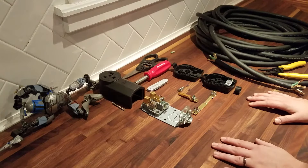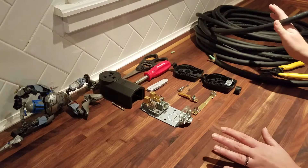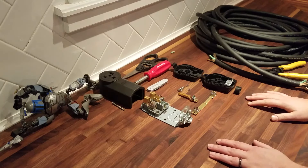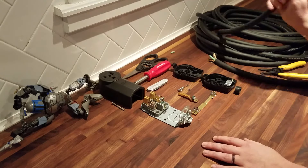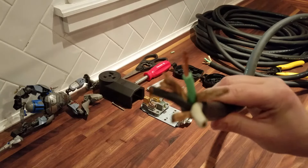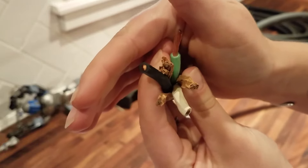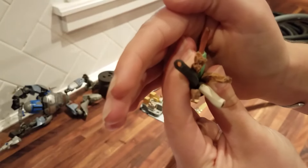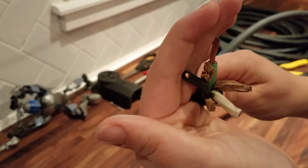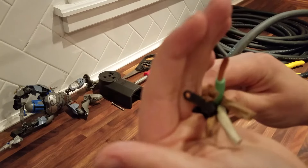So what am I doing here? I am going to be constructing a 240 volt capable cable so I can run my welder, which can run off of 110 or 220. These three cables are 10 gauge each. Because there are three of them and they are 10 gauge wire, it is considered a 10-3. That is how you know what to purchase — you will have to do extensive Googling. It is a SOOW wire.